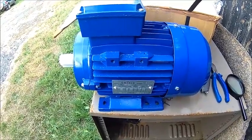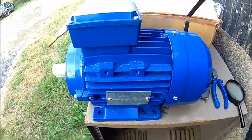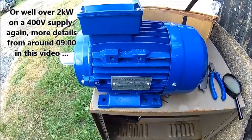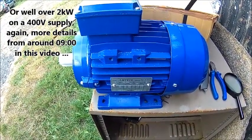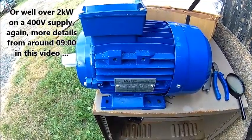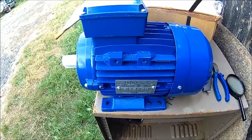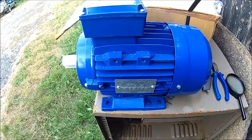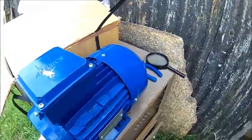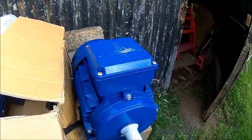Here we have the opportunity to make that motor work. What's it rated? It's 1.1 kilowatt. So it may have 1.2 kilowatts continuously rated at 1750 RPM, at 230 volts or 235 — I've got 240 here. Or at 440 volts, we can go up to probably about 1800 RPM at full voltage. But that was the idea. However, I need to send this guy an angry email because this is just ridiculous.